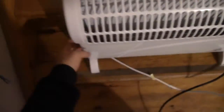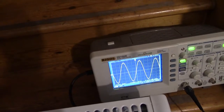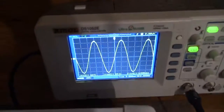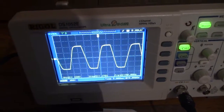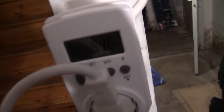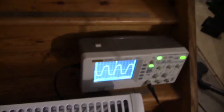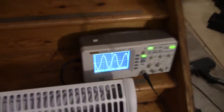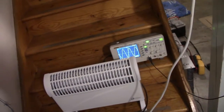Now for the real impressive test — let's do both switches at 1500W. That will actually turn it into proper clipping. But we still have 176V at 850W. That's where we start to run into some kind of upper limit, which is probably related to the output impedance of the transformer.